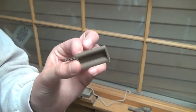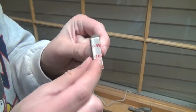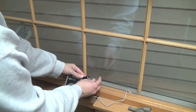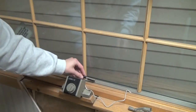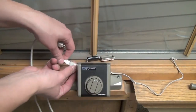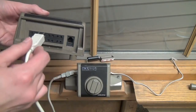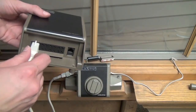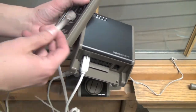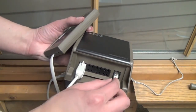Attach the safety connector. The bottom is a sticky peel-off backing and will stick on the base of your screen. If the connector comes unattached, the power operator will not function. Plug in up to 4 power operators to the power supply. Then connect the remote. Your kit includes screws so you can mount the power supply and/or remote on the wall or other surface.